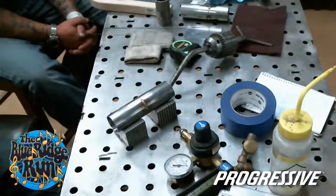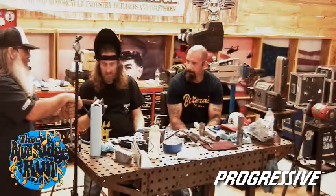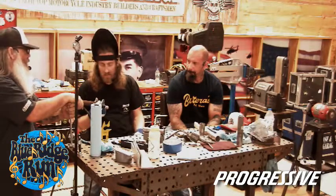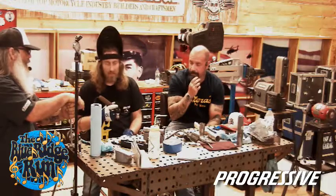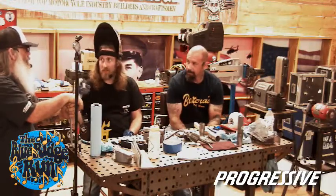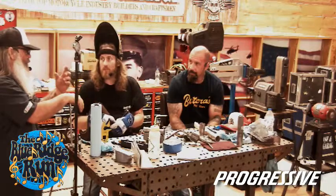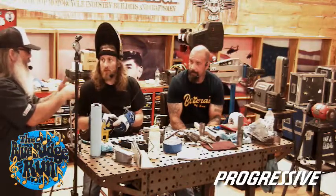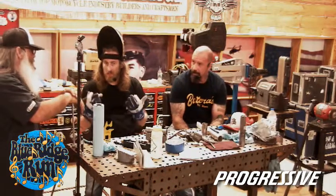Yeah. And they say it could melt away and fall in, contaminating the weld also. That'd be a pretty high amperage, because it wouldn't happen otherwise. But if you're at 150, 170. If you were using a thicker, bigger piece of metal, you wouldn't need that direct a point. You'd be able to shorten that. Right, but you could go larger tungsten, and then it won't melt away from the heat.